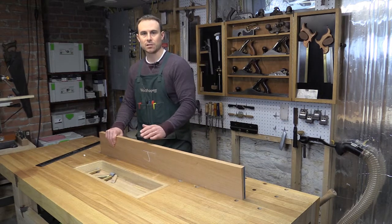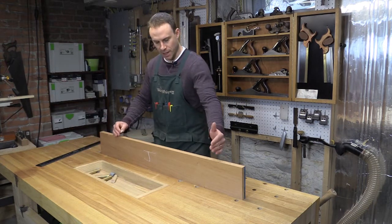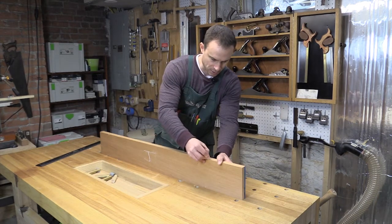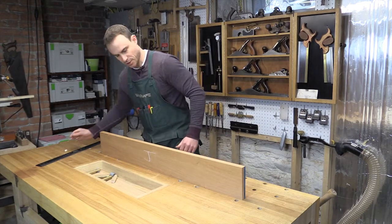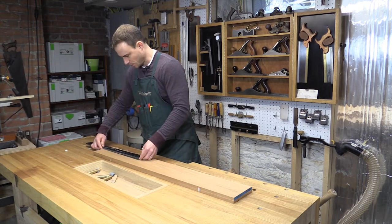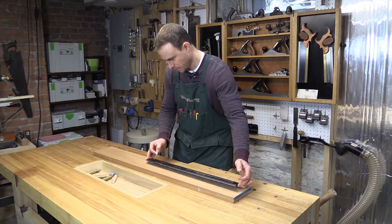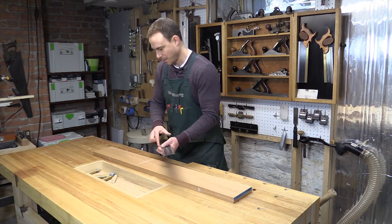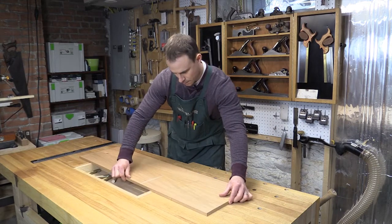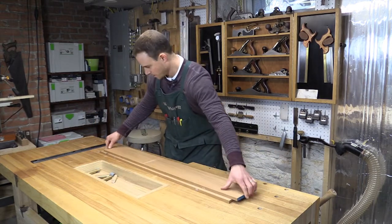The dimensions of this overall piece are roughly 15 by 24 inches. To make sure I keep the orientation correct, I'm just going to put a single chalk line on one side and a double chalk line on the other side, so I can match these up if I get them mixed up. Then I'm going to mark 15 inches out of one side, add a little bit extra, and make sure I can still get the 24 easily out of the other piece. I'll then flip that over to mark where I'm going to make my cut on the second piece and take those over to the sliding compound miter saw.